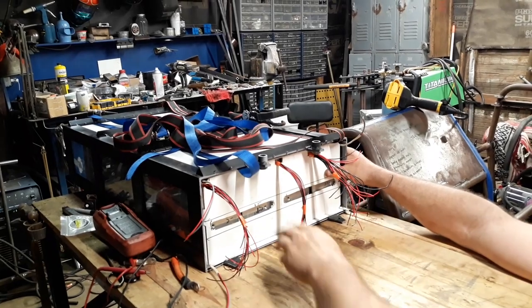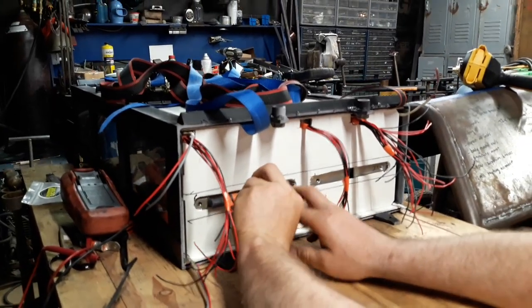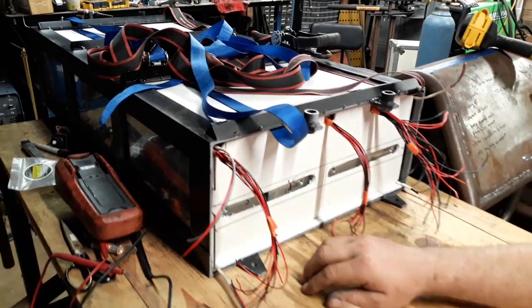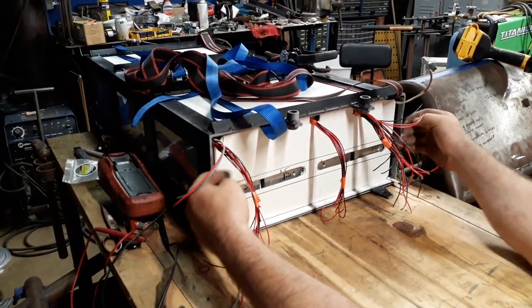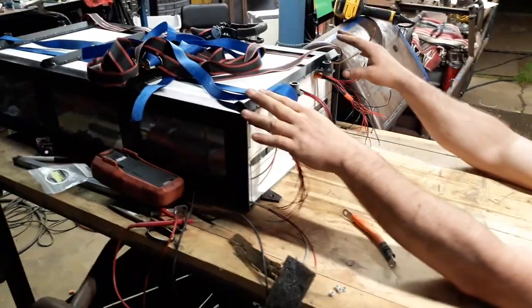So you can see I cut out the end plates so we have access to the intermodule bus bars, which for now will be these kind of pieces here. So they're almost to the right length. And then we'll be adding a steel bar across here, bolted from the outside with countersunk screws to make sure that the module doesn't move out this way. And then we'll probably put another cap over the top.